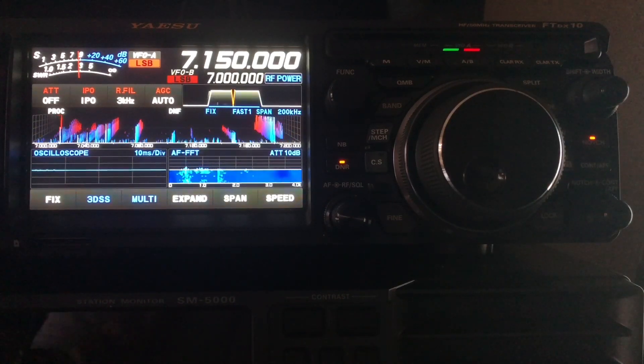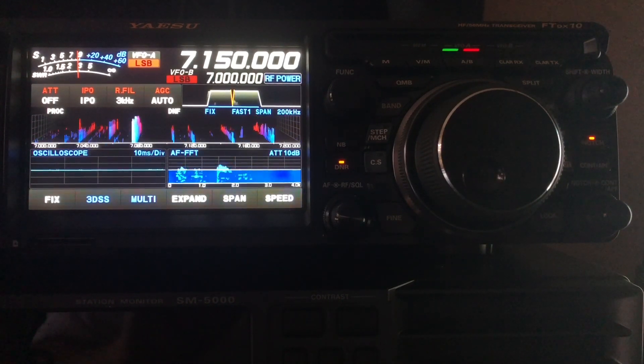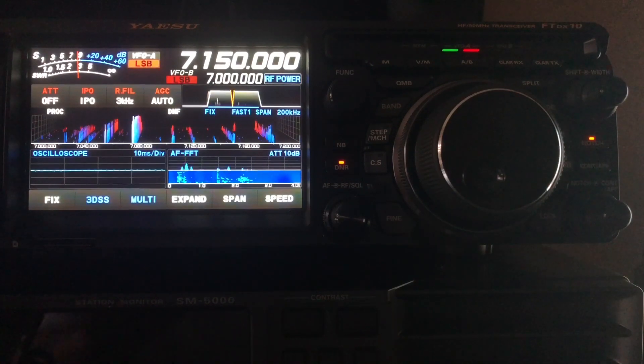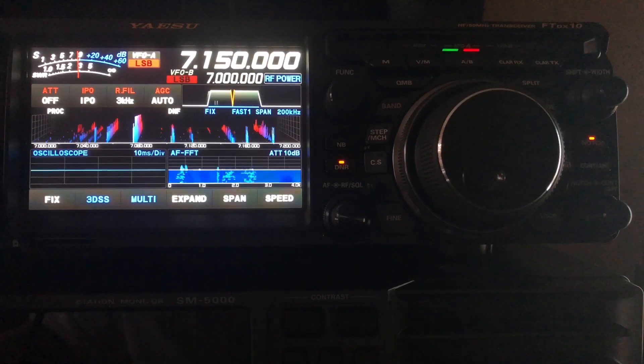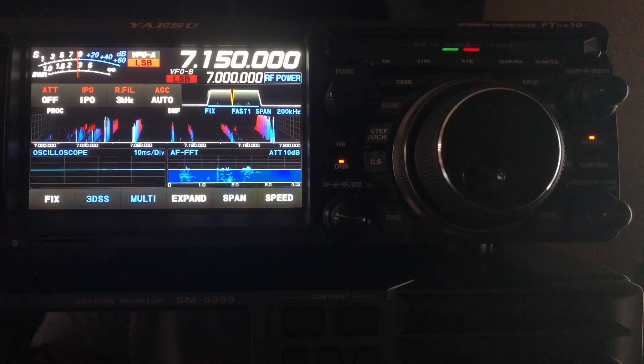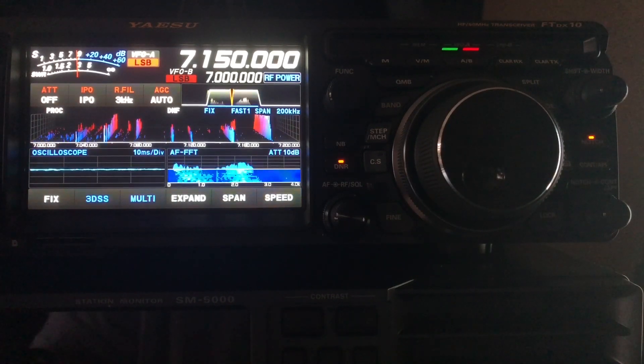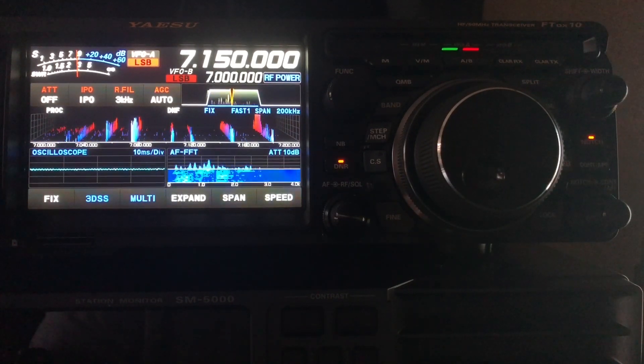You have five channels for USB sideband and five for CW. I'll note that even though it's five megahertz, it's USB. For the rest of the bands from 40 meters down to 160, it's generally lower sideband — 60 is an exception. That's because government agencies, when they use sideband, they use upper sideband. And we're of course also limited to 100 watts ERP.